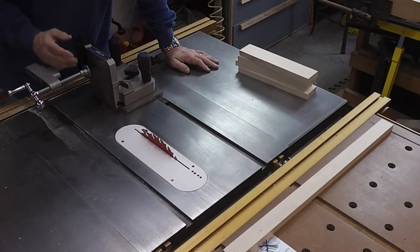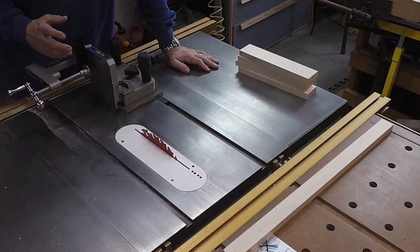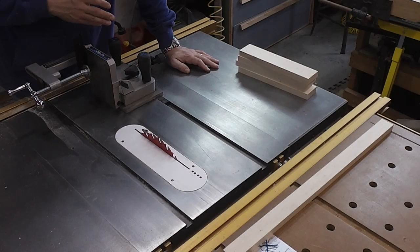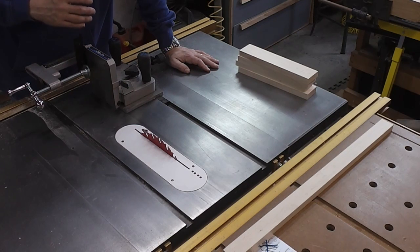I've got my tenoning jig set up to start making these bridle joints for the through mortises on the bottom rails and the top rails. I originally was going to use the band saw with the shim trick, but unfortunately I wasn't happy with the quality of the cuts — they just came out really crappy and would take too much cleanup, which is very difficult in hard maple with hand tools. I thought I'd use a stacked dado blade, but the problem is it's a 6-inch blade and it doesn't go up high enough off the table. So I'm going to be using a ripping blade because it's got a nice flat bottom. I am going to be cross-cutting some pieces, but the pieces are small enough where I'll be okay. It's going to take multiple setups, and I want to make sure I've got everything marked.